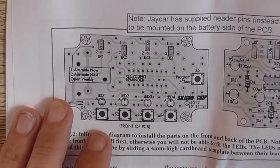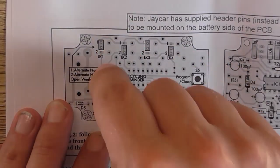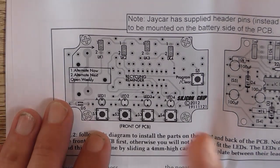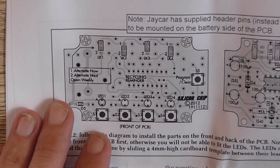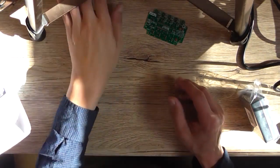Okay, yes, the link wires are actually jumpers by the looks of things. See the boxes, so you can actually pull them out and put them in various different positions to set the settings you want. I did read the description about the link wires and what it did with the IC, but to the person constructing it, it's really not that important of information to pass on. So those link wires are changeable, so you don't have to hard solder it.